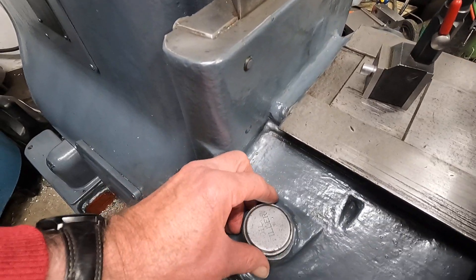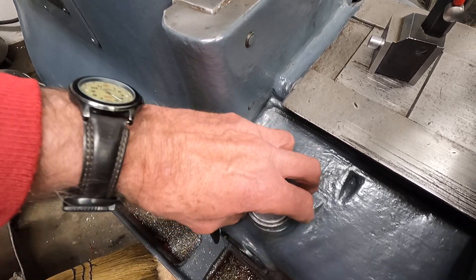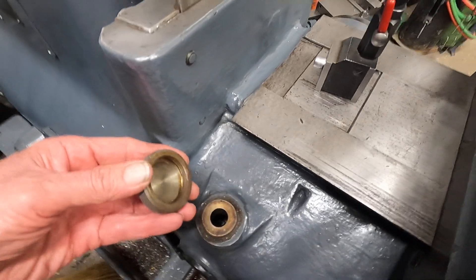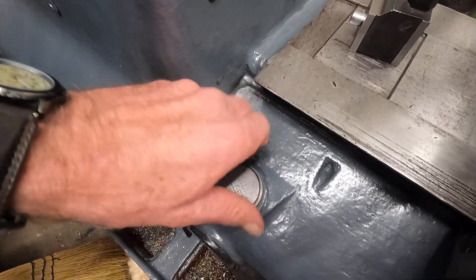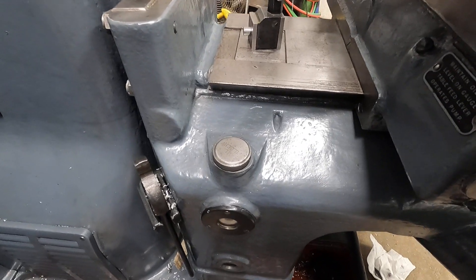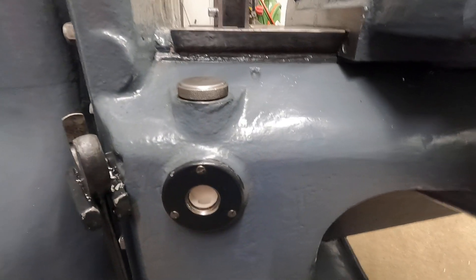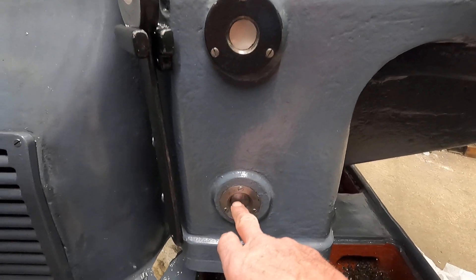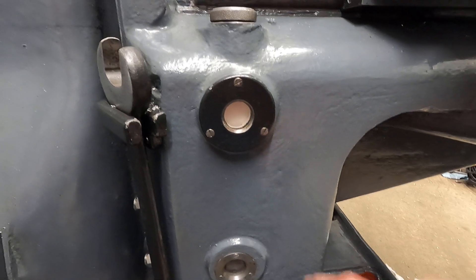The oil - here's your oil filter, here your oil filler - they just recommend hydraulic oil, regular circulating oil. When I first saw this machine, some kids were trying to put dirt down that hole, which was a motivation to buy it. This knee takes regular hydraulic oil, and one of the little problems is that my little window I repaired here is not filling up with oil, so I got to figure that out. I overfilled it but when I run it, it drips in the window.